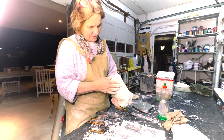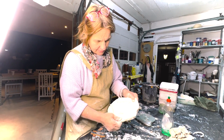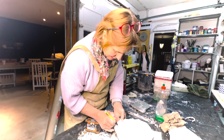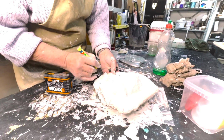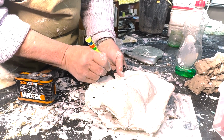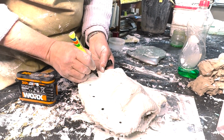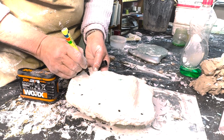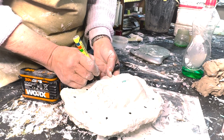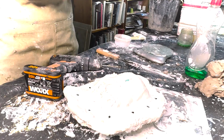Right, so we have a fairly sturdy casing. We're going to open it and angle grind that, but before we open the mold, you have to drill your holes. So you do it roughly about 10 centimeters apart. Amazing how many you should have. It just helps with avoiding a leak. Not that you're not going to have a leak, it just happens. But that should be enough holes.